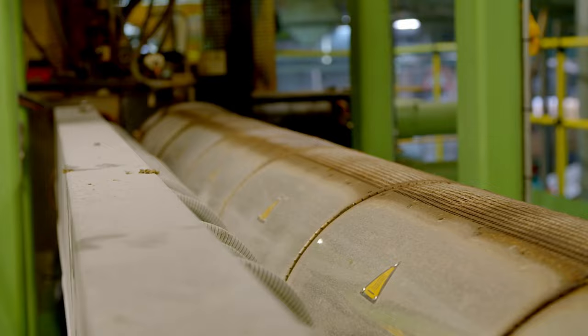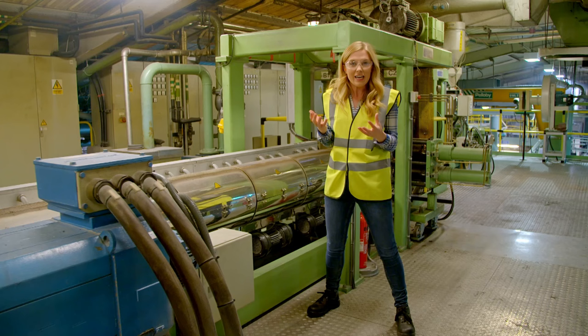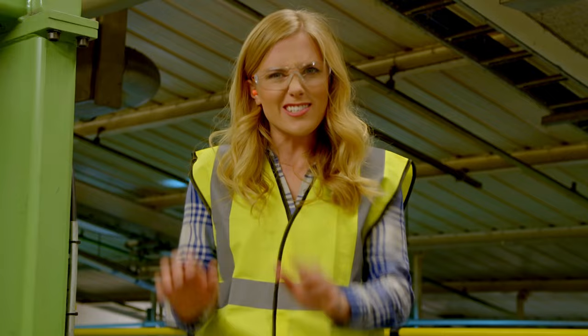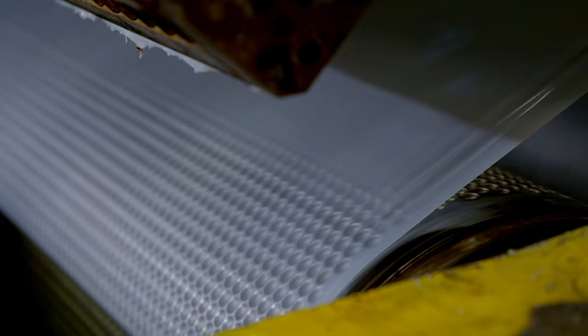This metal tube is called a screw and barrel, and inside, those plastic pellets are spinning in a spiral pattern. As they move along the barrel, they're getting heated until they're really, really hot and runny. The melted runny plastic is then stretched into a thin film, which rolls out onto these metal cylinders. It looks a little bit like cling film — the stuff you wrap your sandwiches in.